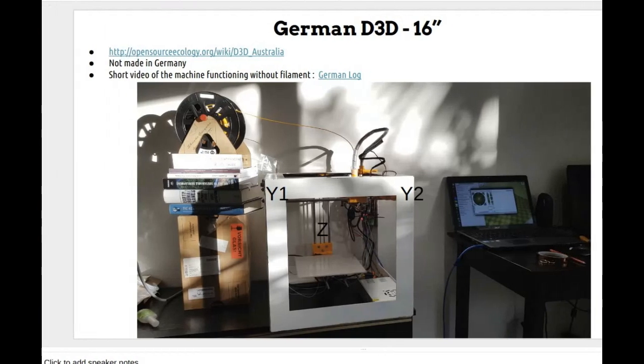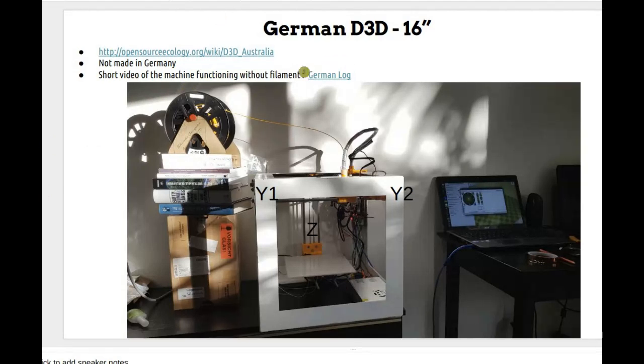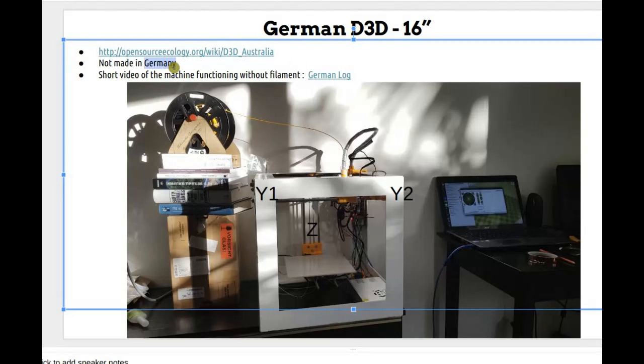Just a quick thing on the D2C. I added on the Z-axis, ideally, what would be needed is a small spring that you can sort of screw around one of the rods. For when that Z-axis does that first dip before homing, I put a bit of foam underneath the carriage at the moment. I see what you're saying. That's a good point, because there is a dip down, and we could also fix that in the code. But that would be a good solution for now, just a little thing so it doesn't go down all the way. Make a note of that in your log if you haven't already.